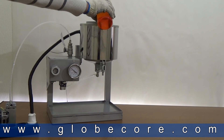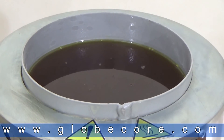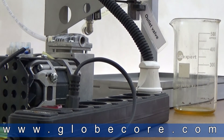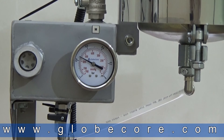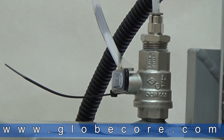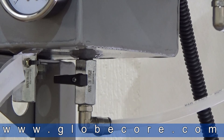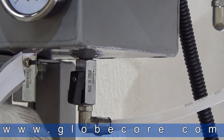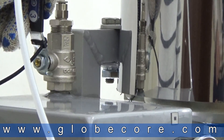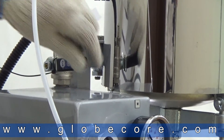Then pour oil into the pod, leaving between 30 to 40 millimeters between the top of the pod and the oil level. Stop the vacuum pump. Engage the heater. Start the vacuum pump and pull negative 0.8 bars of vacuum in the vacuum chamber. Close valve MV3. Within approximately 15 to 20 minutes after compacting, gradually open valve MV2. Start the vacuum pump and open valve MV3 from time to time to maintain negative 0.8 bars in the vacuum chamber. After stopping the vacuum pump, close valve MV3 to prevent air leaks.